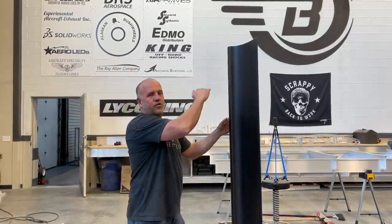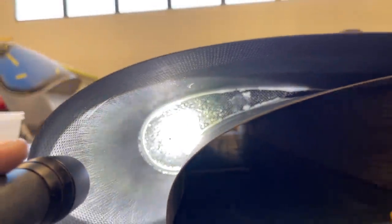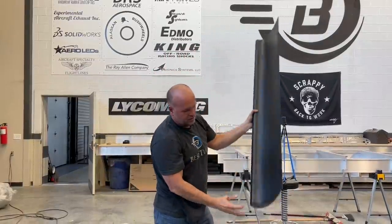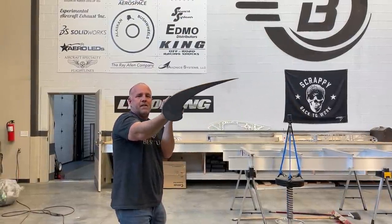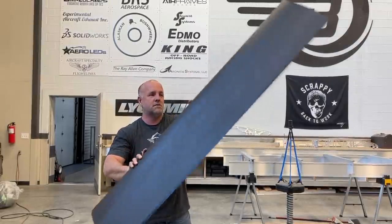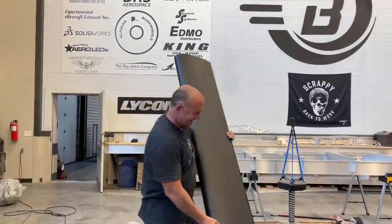So when I put the ribs inside this slat, all the ribs, I drilled a big quarter inch hole right in the middle of it. So it wasn't anywhere near where I had glue to bond the part together. So right in the middle is a great big hole through every rib all the way down. But at these ends, I just want an eighth inch hole instead of a quarter inch hole right at the two lowest points. And as this sits on the airplane like this, the lowest point, in case somehow water got in it, which is very unlikely, but if it did, it could drain out, but mostly it's just to vent it. So here's one, ready for some clear. You guys know the drill, back to work.